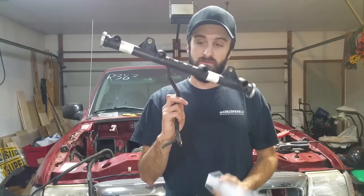We're going to use some graduated cylinders, fuel rail injectors, and a little bit of magic. This is a DC square wave frequency generator and it's going to be adjustable. Hopefully it'll work to activate a relay — I'll be able to adjust the frequency and the injector pulses to get the dynamic testing done. If this doesn't work, worst case we'll still be able to do the static testing where we put the injectors on and run them to get a measurement.